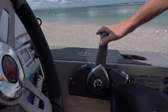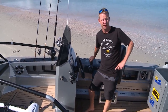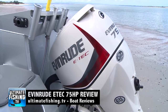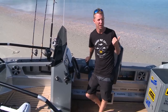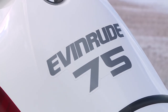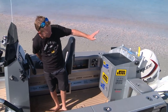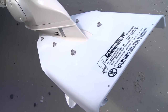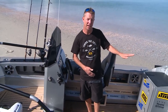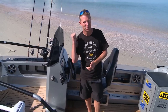The throttle remotes are kept off to the side so you don't bump the boat in and out of gear when walking through the console. My choice of the E-TEC outboard is straightforward — you get everything a four-stroke offers: the economy, low emissions, and quietness. The one thing you get extra is fewer service intervals than a four-stroke. I've set it up with a Perma Trim so on a small boat in chop I can plane at lower speed and really control the trim by tweaking up and down.